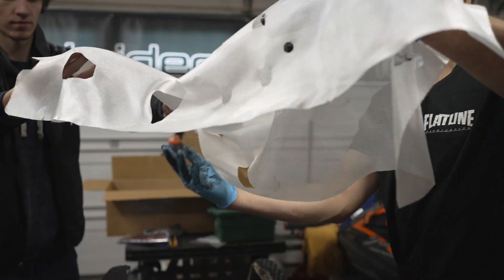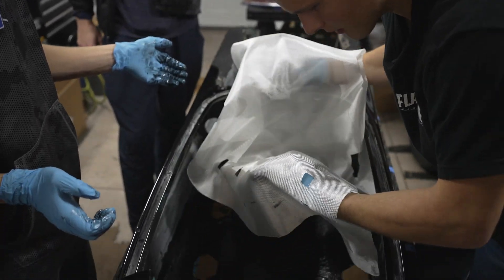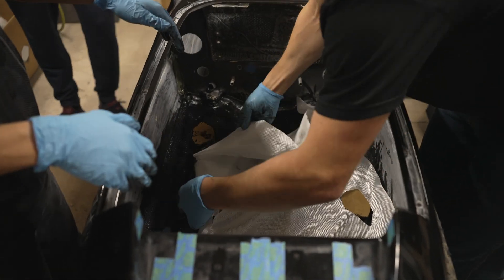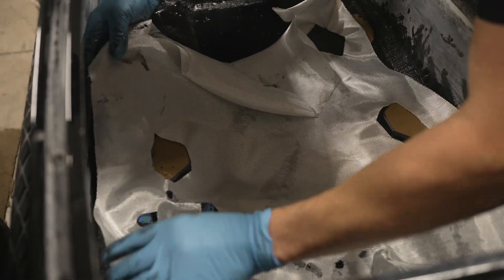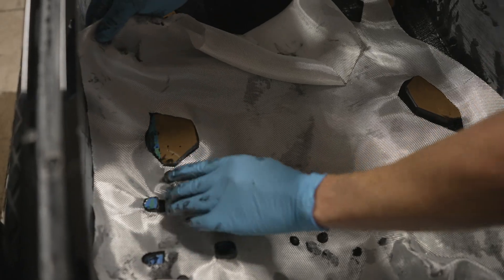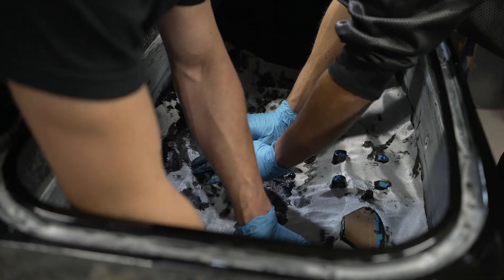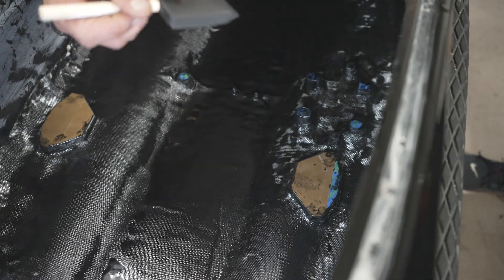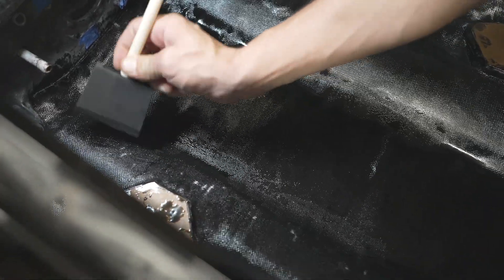Slowly hand me the whole sheet — we got to make sure it's the right orientation. Pop it in here a little bit with those holes aligned. Work from the middle and try to get the fibers to line up square; you can twist and pull them to get them square. These foam brushes are good to use because they don't shed hairs like other brushes do. When you're doing the six ounce you don't want any brush hairs ruining the nice finish you're trying to get.